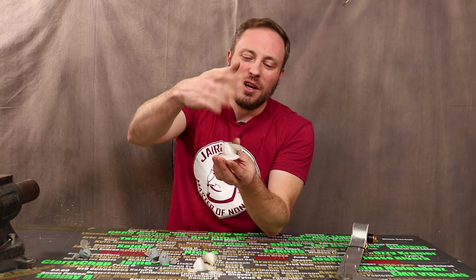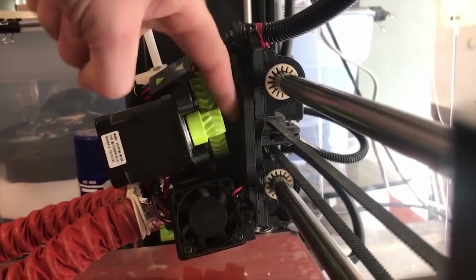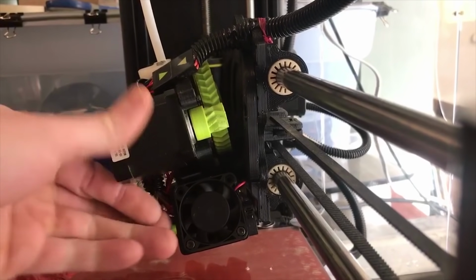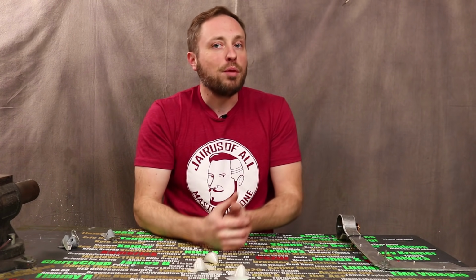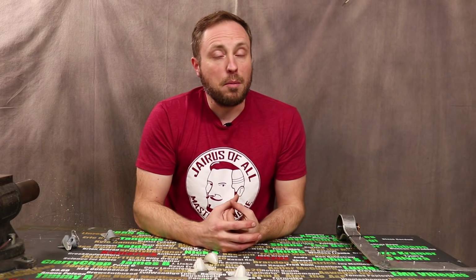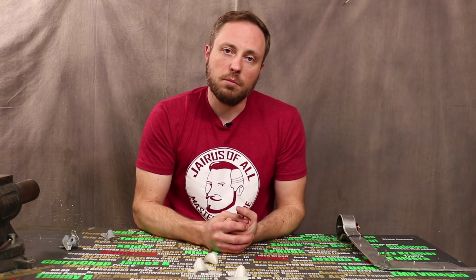You can see the swoop from when the print head sagged down, it moved to the side, which is why these look so goofy. A lot of the parts on my printer are made of 3D printed parts, and I didn't know what plastic they were made from. I was hoping they might be nylon, but apparently they're ABS or something like that, because it's hot enough in there that it melted it and it sagged. Now I need to replace those parts with something that doesn't melt.